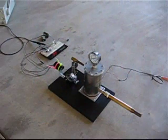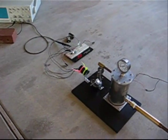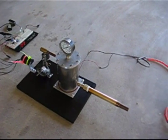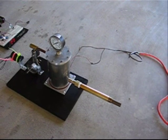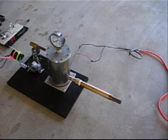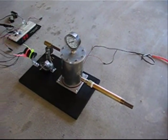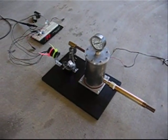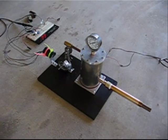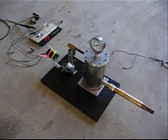All right, Captain. Here's our setup — we just did our successful run. There's the oscilloscope and an infrared sensor to determine the RPM, which we figured was about 600 at the peak. At the right side of the engine, you see the cardboard tube sticking out there. That's a safety mechanism built into the design: if the pressure builds up, the fuel log will push itself out a little bit; if the pressure gets too high, it'll push all the way out and stop the combustion. You'll notice that during the test run, the pressure fluctuated because of gunk that got in the engine and built up a little back pressure. We can repair that with a cleaner-burning black powder and better filters.